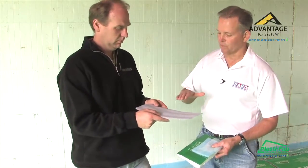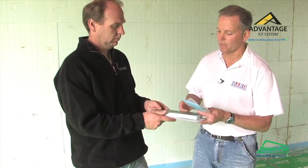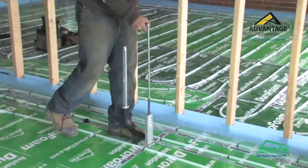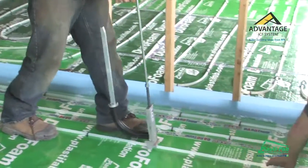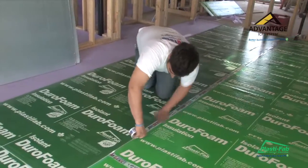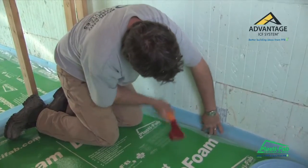That's very different than with concrete. What I've got here is the five mil — that gets placed first. Then these are just four by eight sheets of the insulation on top. Then we have special clips and guns which the tubing gets placed with — we supply that to the mechanical company and they simply click it into the insulation. We tape the joints on the insulation.